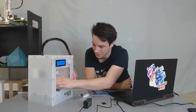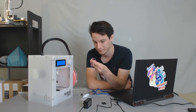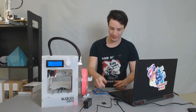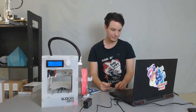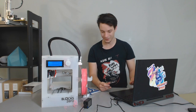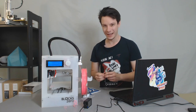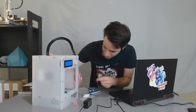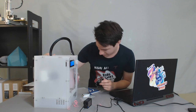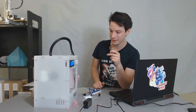Yeah. So it was extruding way too fast, which is because it was trying to move the filament to the hot end quicker, which is why it made this thick gump. But yeah, okay, that's doing its thing. So the next step is to, I guess, make a profile for it in Simplify 3D, I suppose. So it's got these little clips. Actually, how do you set the bed height? That's probably an important factor. It's got little screws. Okay. There's a couple little Allen keys. All right. So I'm going to set the bed height first, then I'll make a profile.